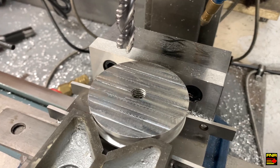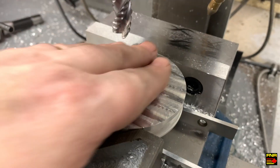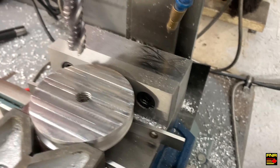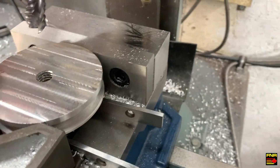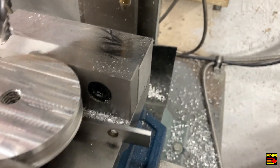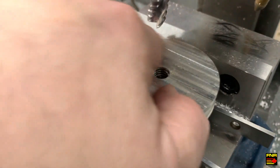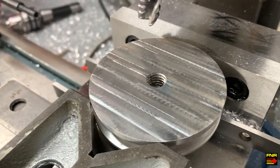Well, that little bit of idiocy worked surprisingly well. You feel across here — that's actually flat. Maybe a little bit of a ridge there, but the parallels are still rigid so it didn't move. It's crushed in here a little bit, but I think that worked. Now I can put it in the lathe and just take a couple of very light skim cuts to fully true it up.